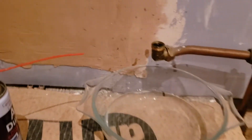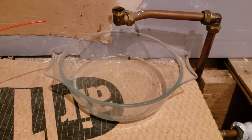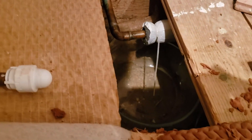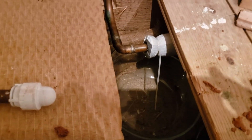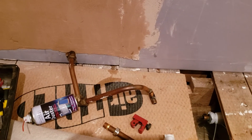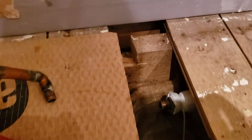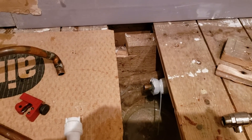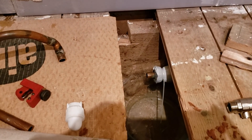I'm going to pause this again and empty that water out. It's still frozen, still not coming out. I'm going to get to work on that now. Cut in that. Pause the video again - right then, pipe's cut, that is now off. Now I'm going to pause the video and attach the isolation valve.